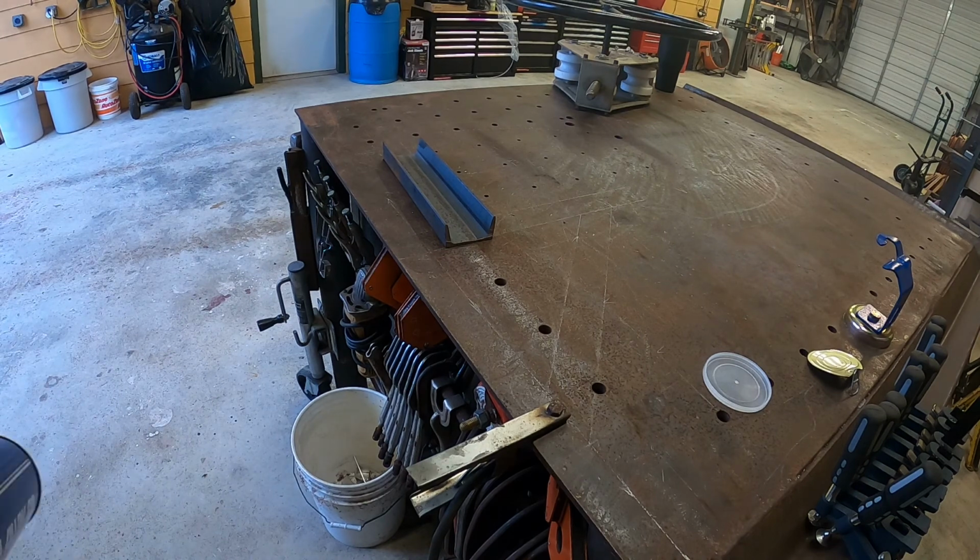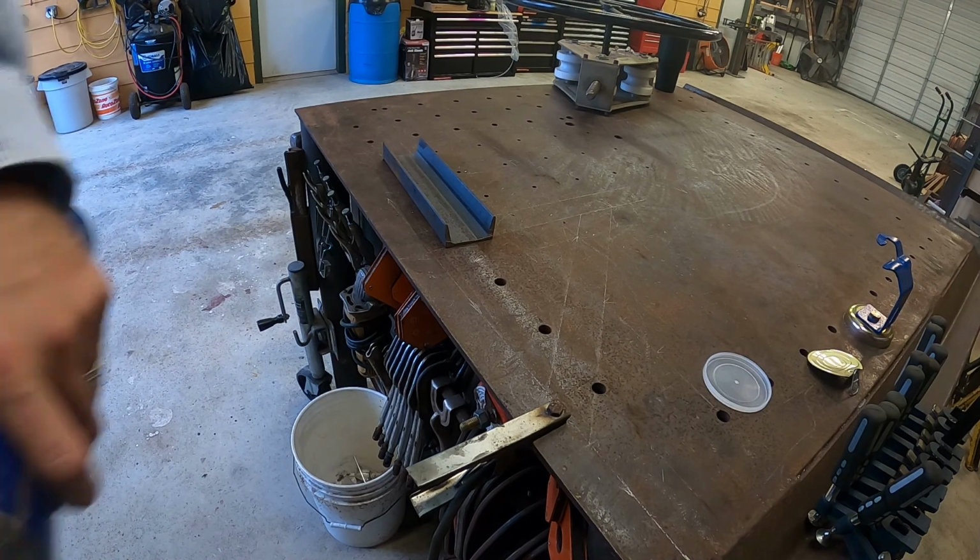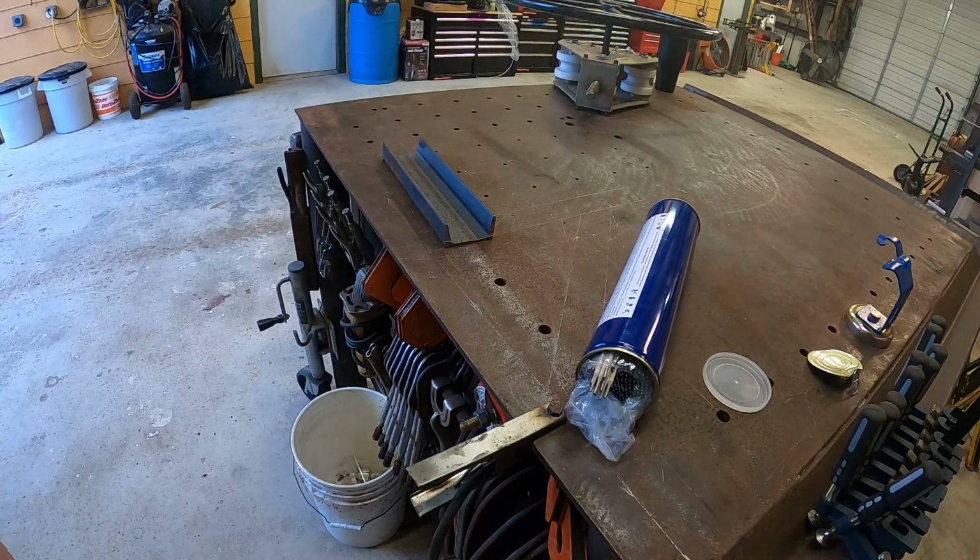Right out of high school, when I went to a welding trade school, we didn't have no classroom time. It was all lab. It was all out in there, using a torch. They taught you how to use a torch. Then they taught you what to set the torch at. And then they told you about the rods a little bit. It gave you an amperage to start off with, to start running beads with 6010. And back then it was the red rod. It wasn't the 5P plus gray rods like it is nowadays. It was the old red rods. And you just sat there and welded and welded.